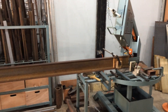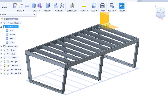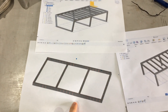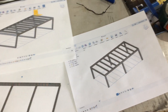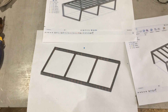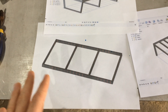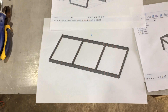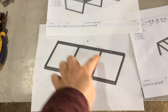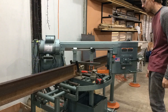Right here is the start of my CNC machine. This is a piece of six-inch channel — it's quite big as you can tell — and here are the basic drawings I've done of what I'm planning to do. This is what's going to be made out of the channel. I might add some more ribs out of thinner tubing, but this will be the main structure that will provide the rigidity and strength necessary to keep all the rails and tracks from having any flex, keeping everything super solid. I plan to do most everything else a lot lighter, but I really wanted the main frame to be incredibly solid and rigid and not to move at all.